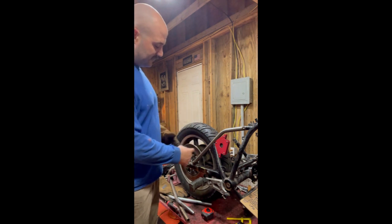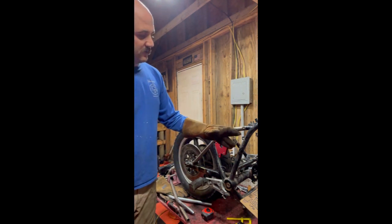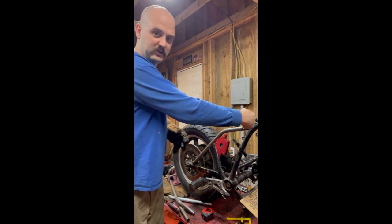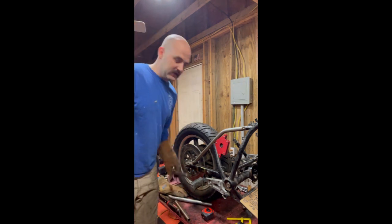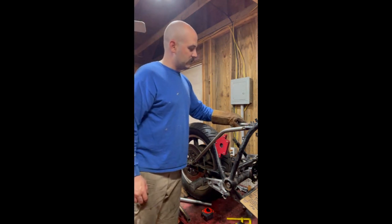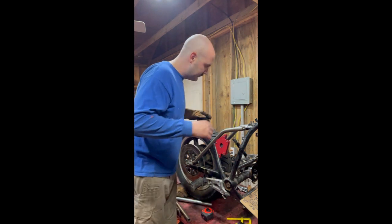So I get my magnet on, get it all held in place, look at all my joints. This one's good. This one's good up here. So the next step would be to weld the plug in the frame and then actually weld that circumference of that joint and then kind of just go down and weld them all in. Again, we're only going to do tack welds for now. Then the next step would be to come to the other side, weld this other upright on. So that's going to go right in there. And then that one will swing into place.